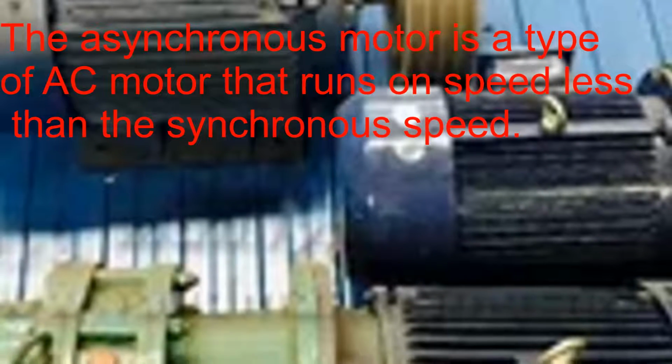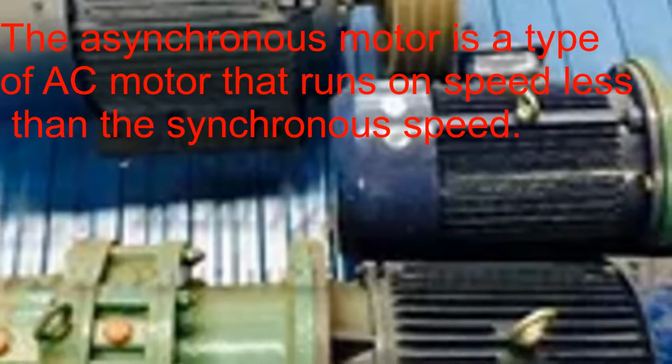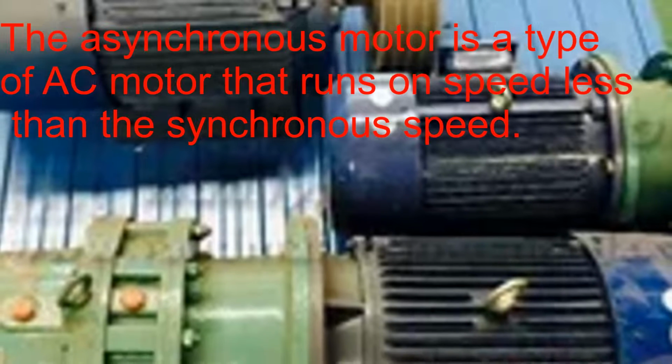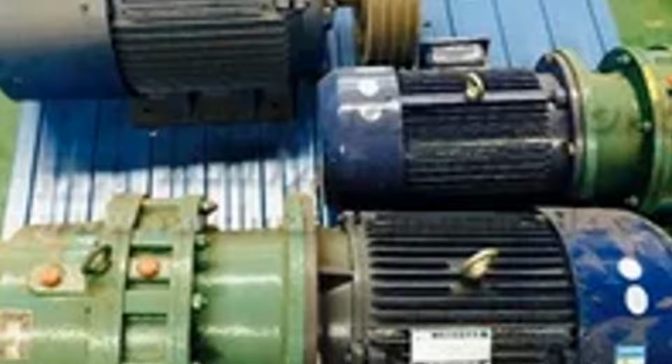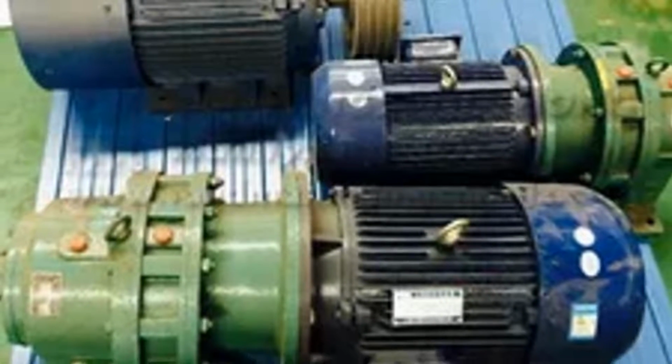One advantage of the synchronous motor is that the magnetic field of the machine can be produced by the direct current in the field winding, so that the stator windings need to provide only a power component of current in phase with the applied stator voltage, i.e., the motor can operate at unity power factor. This condition minimizes the losses and heating in the stator windings.